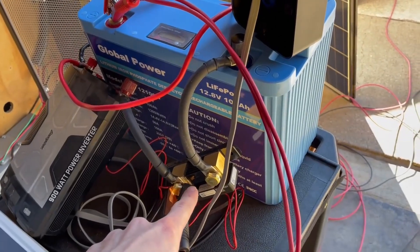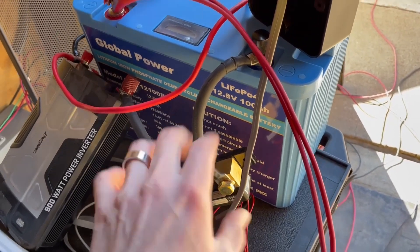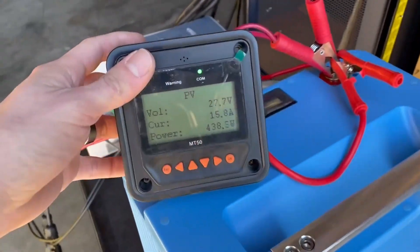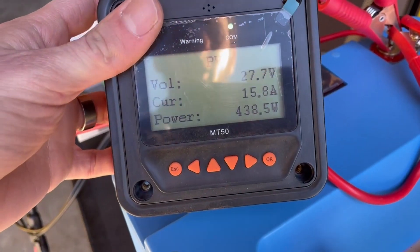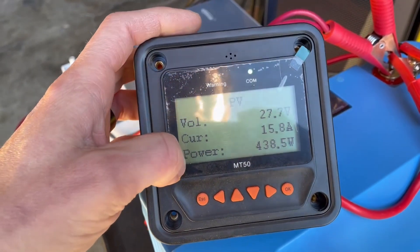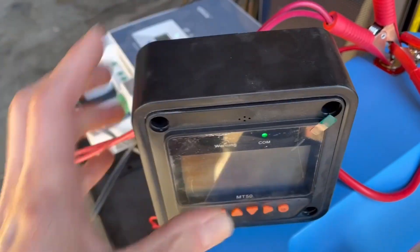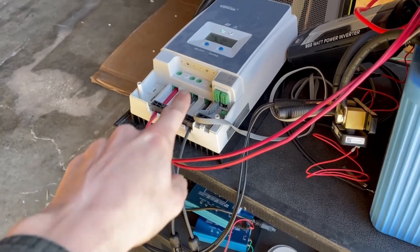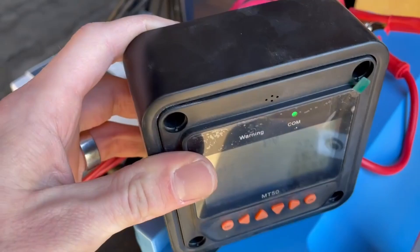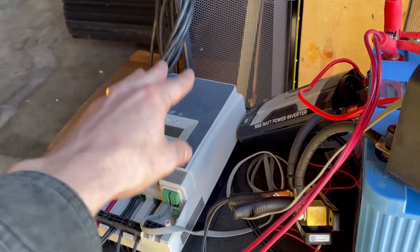The circuit goes through a shunt on the negative side, as it should. The piece I was really playing with today is a Victron smart shunt I purchased so I can see how much power is actually going into the battery from a third-party device, rather than relying on the solar charge controller's own monitor. That's because the charge controller measures power coming in from the panels — not power going out to the battery — so its reading is inflated since it doesn't account for the controller's own inefficiencies, which are typically 10% or more.